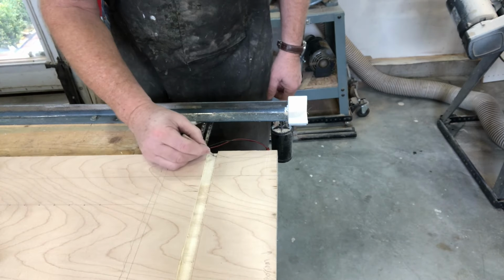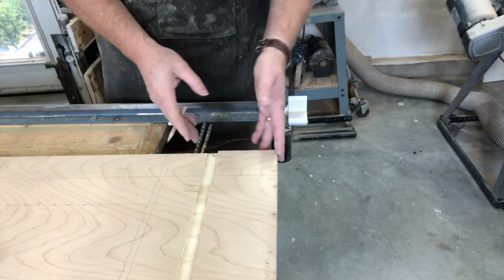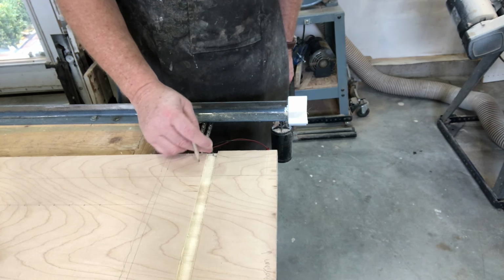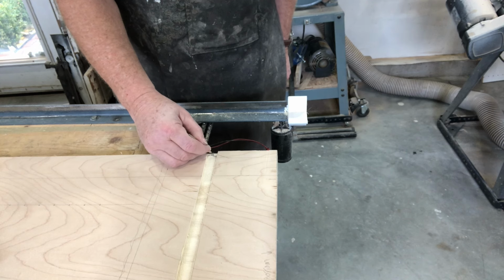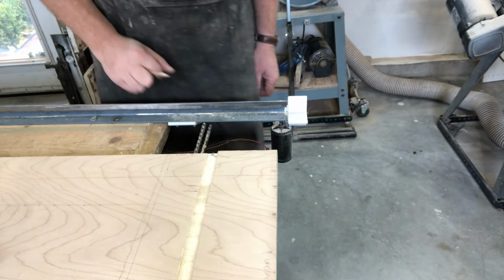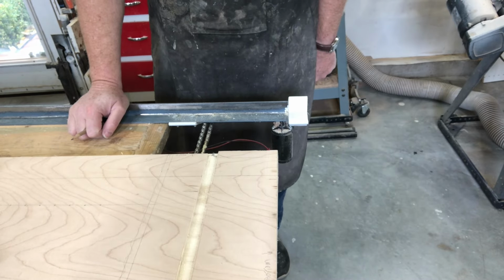and that requires then that on our bottom shelf here, we're going to have to make a little bit of a notch as that comes in to accommodate the top of the baseboard. Still gives us, when the back of the cabinet comes down, a good purchase here, so the back of the cabinet will come to there, almost touching the top of the baseboard, but it will be able to be tacked into the back shelf. So that will work. We're close, but it's going to work out well.